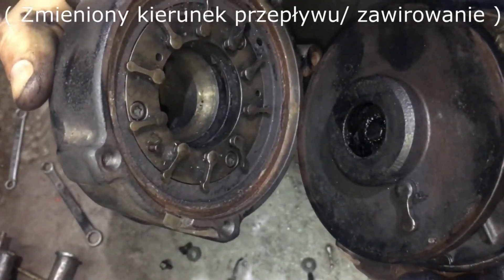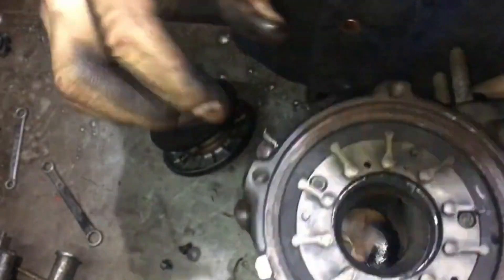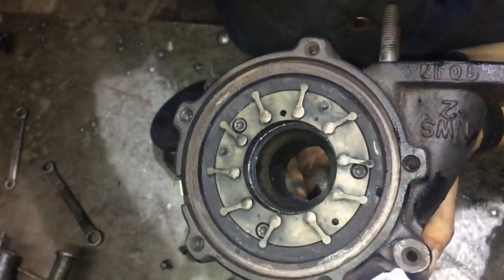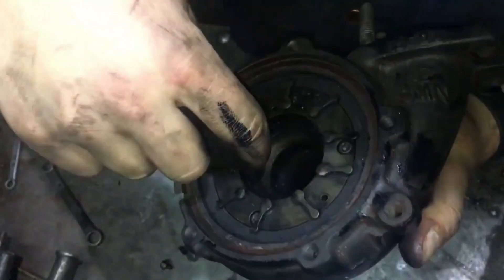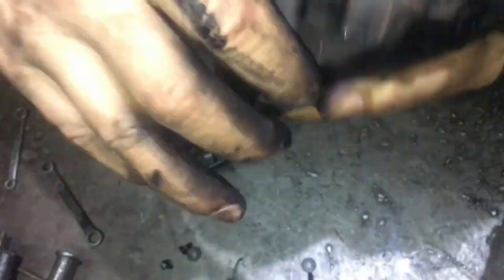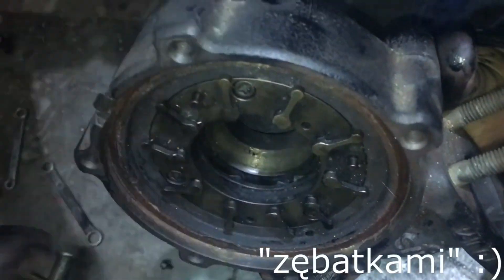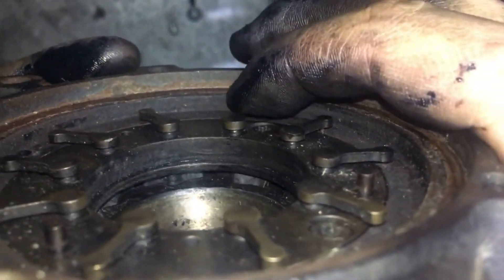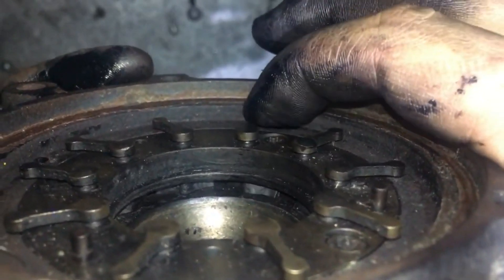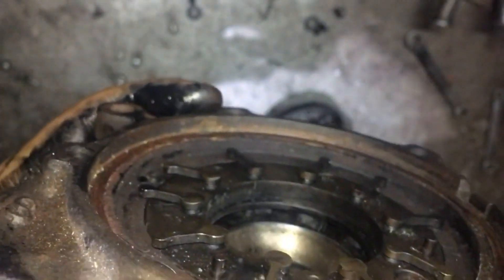The flow becomes restricted. But, for clarity, the flow is not regulated only by moving the actuator rod. These vanes are regulated internally by small gear teeth. Look — here is a piece of it. You can see how they move.